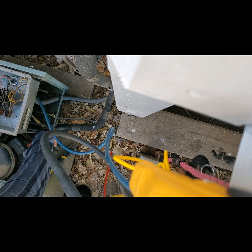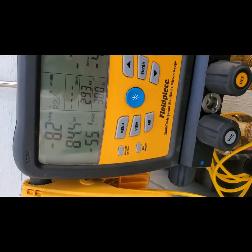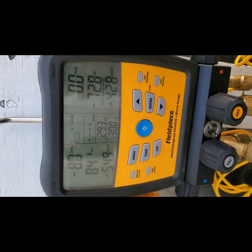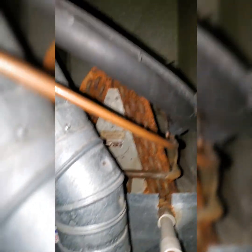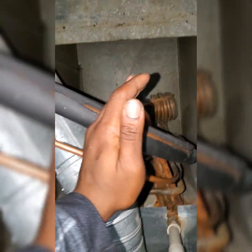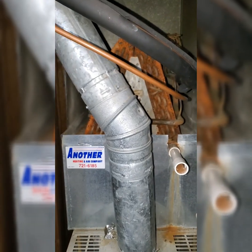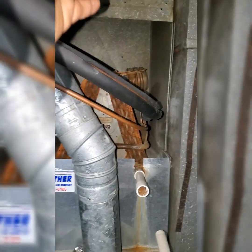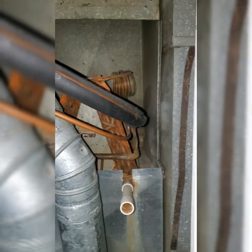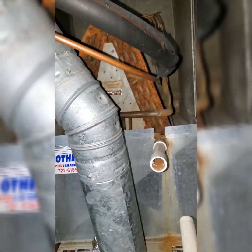Negative 8.3 — so that's good. We have no refrigerant in this line set. I cut it open and don't have to worry about losing any. So here's the evap coil. I'm kind of doing this in reverse — I already actually looked and I saw that the issue is under the evap coil. So we pumped it down and now I can cut it right here, open it up, and actually remove this evap coil. I may need to get rid of the flue pipe for a little bit and make sure the furnace doesn't come on. I'm going to cut right here so I can solder it back up right here in front.